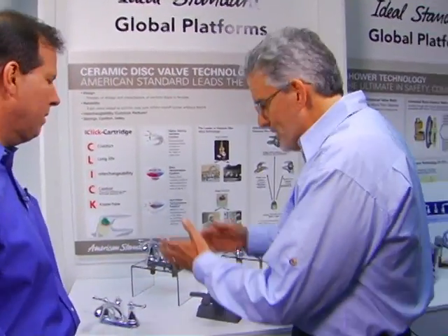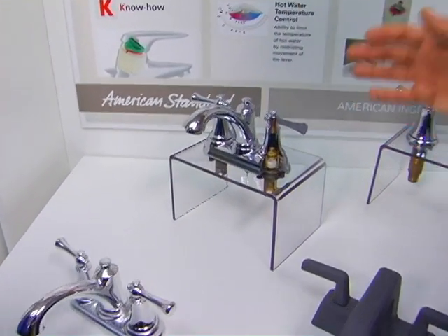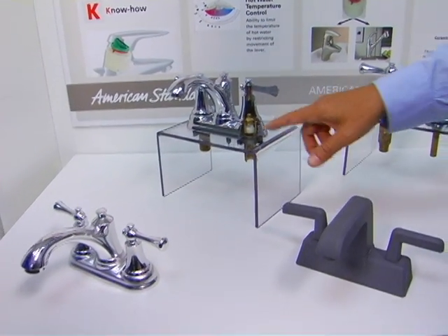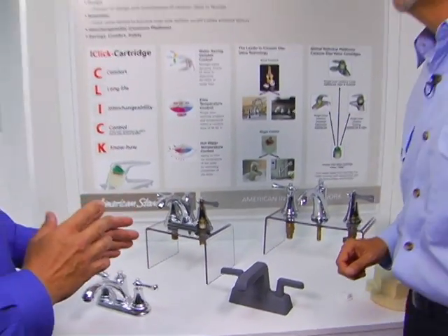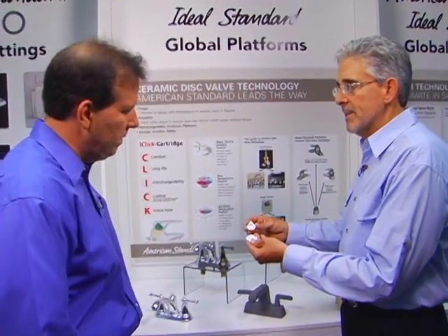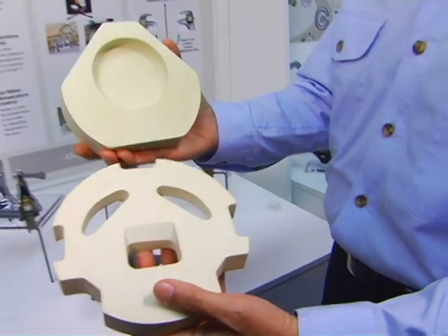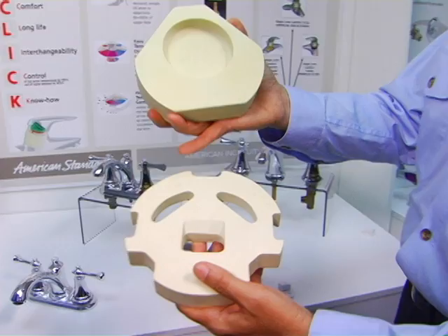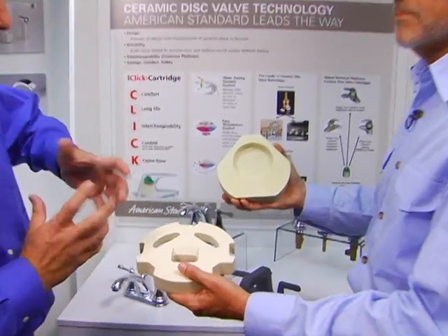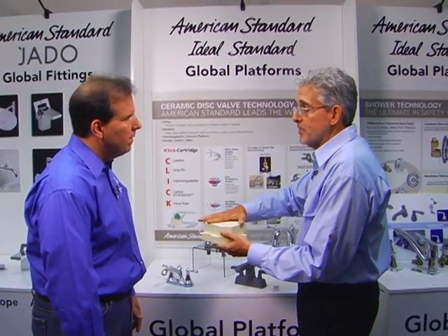So you kind of start from the outside in. How do you get to the actual functional part of the faucet? Once we've defined the design, engineering takes over and defines all the outer surfaces that will be in brass, all the internal waterways. They define the body, the spout, the handles, and finally we locate the ceramic disc valves. That's really the most important part when it comes to performance. How does a ceramic valve work? Well, a ceramic disc valve is made up of two ceramic discs that are near diamond in hardness. The hot and cold water come in through the larger oval holes, they mix in the chamber, and then exit through the center hole. So as you twist it, you basically change the mix of the water? Correct.